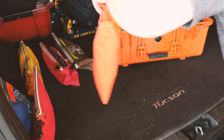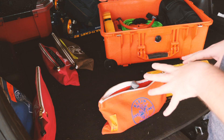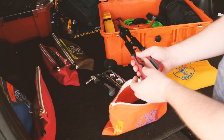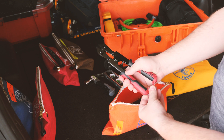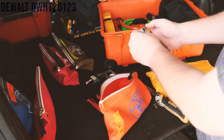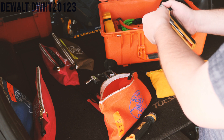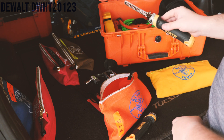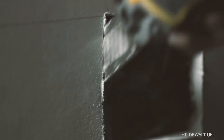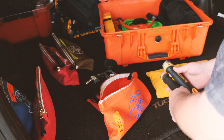Now let's look at the Etcetera bag and the Crimp Strip Punch bag. As I said earlier, this is really mostly about mounting and cutting — small hammer, a level, a small chain cutter. This right here, which I have two of, is from DeWalt, folding, which is nice in a toolbox like this. But what is also really nice about this is it has a file. What this is helpful for is if you don't get the opening quite right in the drywall, you can use this file to get exactly where you need it. This is the best drywall knife I've ever used — I love this thing.